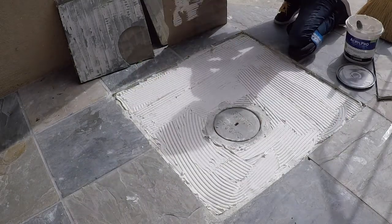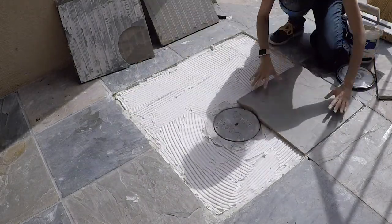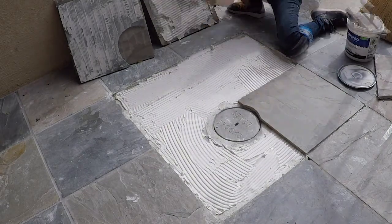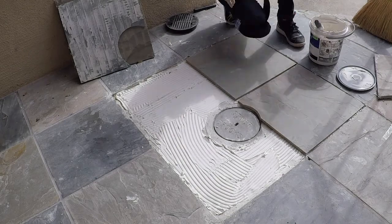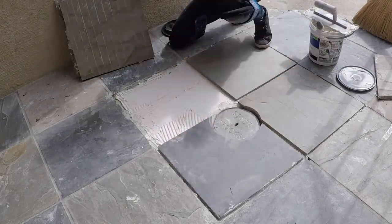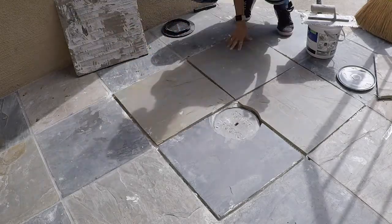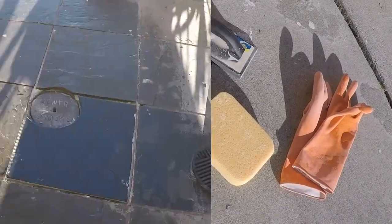Notice how when I lay the tiles down that I'm not using spacers. The original person who laid down the tiles before didn't create the lines evenly, so I'm just matching according to that instead of evenly spaced grout so that it will all match.